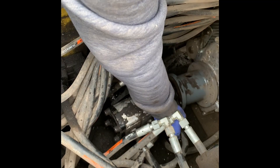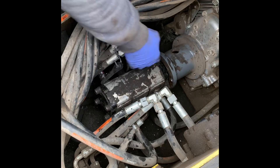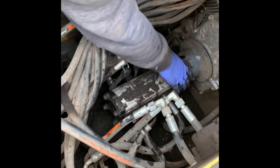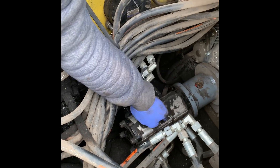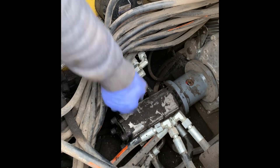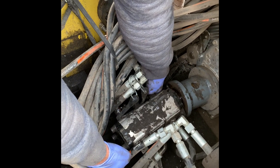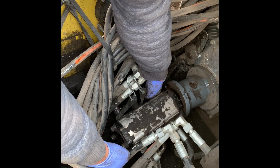I got the pump disconnected from the spacer here — you can see that. Now my plan is to figure out what kind of thread goes into the spacer back into the engine block, then I'll bolt that spacer back on and align the pump. I might have to disconnect some hydraulic lines, but we'll see about that.